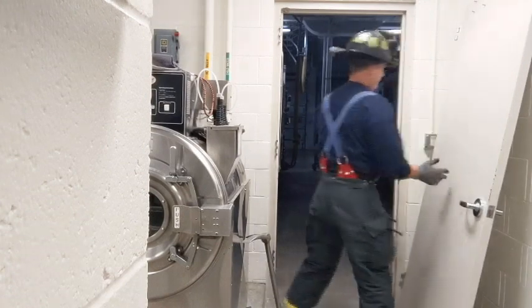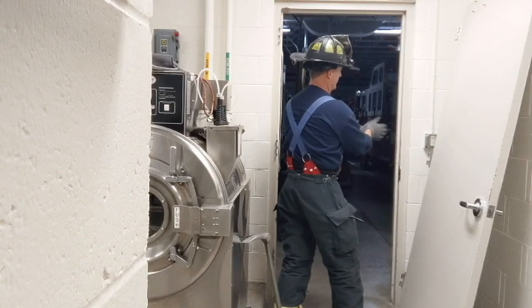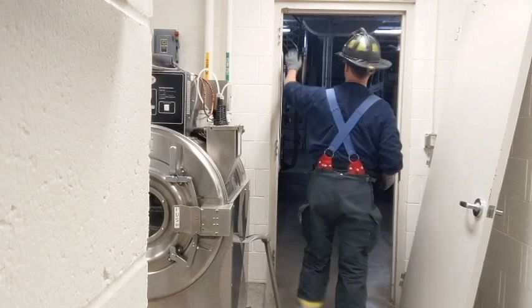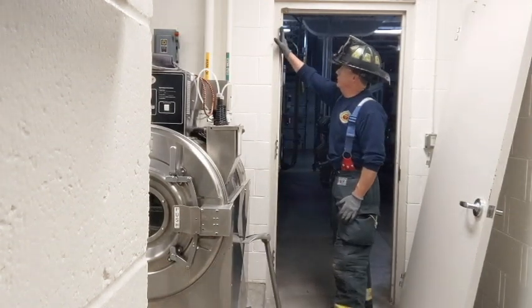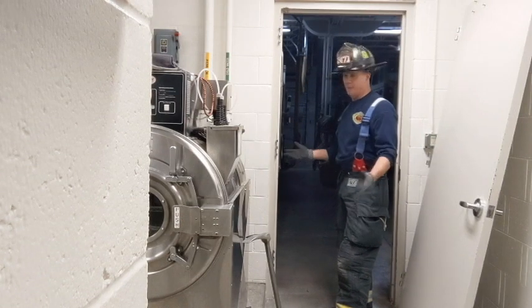To reverse it, you're just reversing the process. The latch side or the lock side is going to go into the strikes or keepers first, and then you work the door back into the hinges. That's best done with two people. You're going to reverse the order: start with the top hinge, get that hinge set, then middle, then bottom.